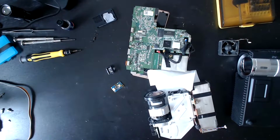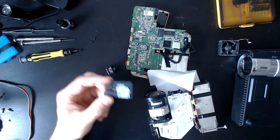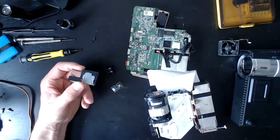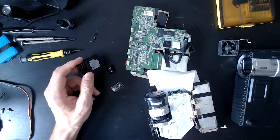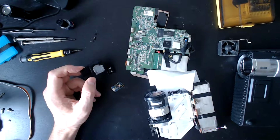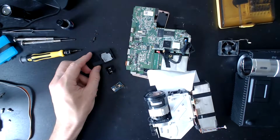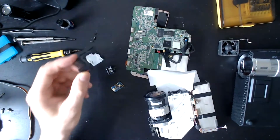I'm speculating at this point, but like I say, my first choice is that the thermal paste failed. Another possibility is that the thermal paste failed as a result of the heat being produced by the LED. I still think that's less likely. I think probably the amount of heat that would be required to do that is probably still below what was being put out here.